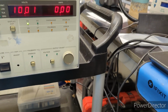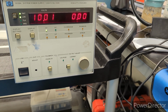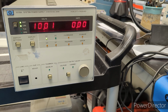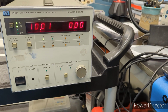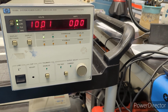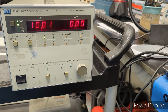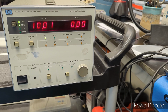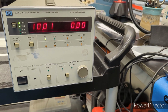And so I am going to check the service manual to see the calibration procedure. I believe I have most of the equipment to perform the calibration. You need an oscilloscope, a digital multimeter, obviously, an electronic load. It says you need a logic pulser and a signature analyzer, which I definitely don't have. Also a current probe. Don't have that. Some power resistors. Oh, well, you need those if you don't have the electronic load. But yes, you need some very, very accurate current monitoring shunts. Like, for example, a 0.1 ohm plus or minus 0.04%, 25 watt resistor. I sure as hell don't have that.